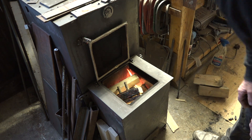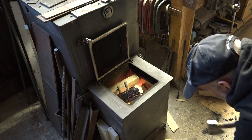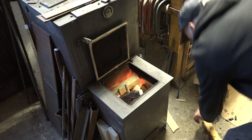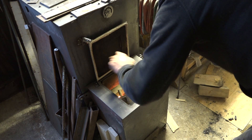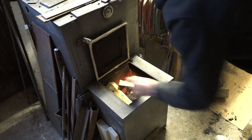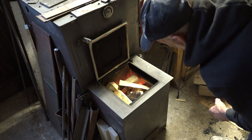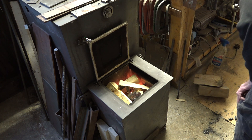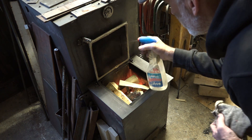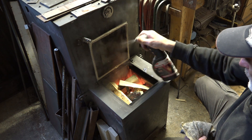You can see that once you get some fuel in here it's not throwing smoke out of the door. All I do is pack the wood in as much as I can — that'll do me now. As soon as that thing gets a little bit up to temperature — on this dial gauge, if it's reading about temperature — I know the riser's hot enough that it'll still burn clean, so I can then shut the door.